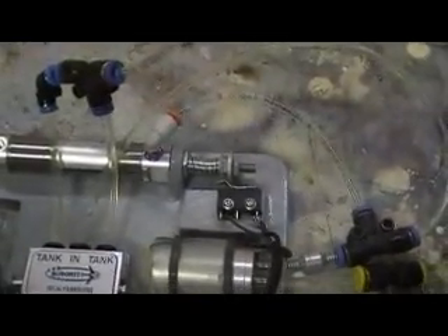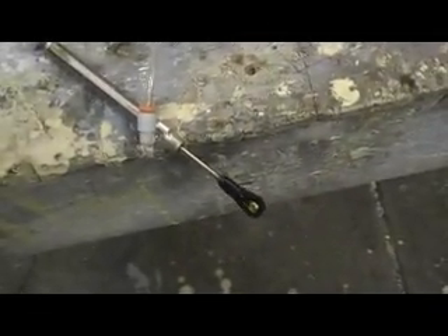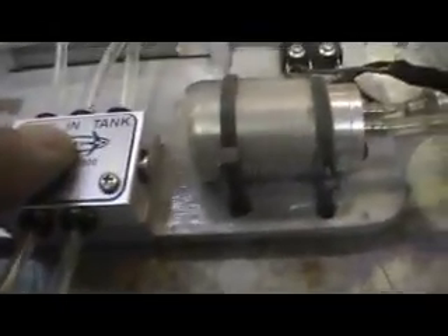I got it plugged in — watch her work. See, that air cylinder is actually working! It's going from the tank into the pump, and out of the pump into my homemade accumulator. It's teed off going from that homemade accumulator to my valve, and that switches it — one's up and one's down — and both drain back into the tank.